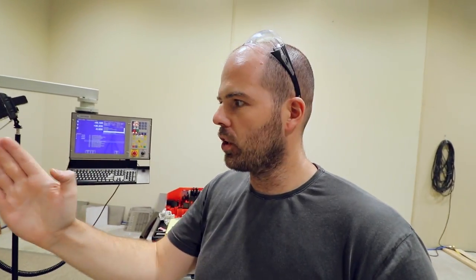There was obviously a lot of deflection by the tool, because when you machine along the edge of something, you're biting into it, and so what happens is you get deflection on the tool. I could see the quality of the cut along the side was just not very good. There were lines and streaks, so I slowed down the feed rate quite a bit, but took more of a chunk off. And it seems to be working, it's very slow.